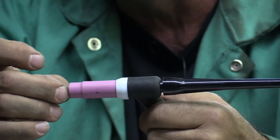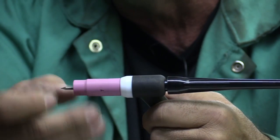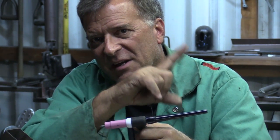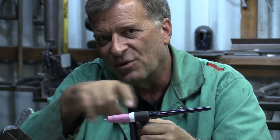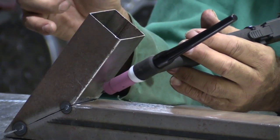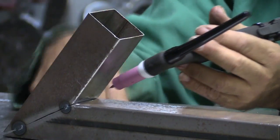One of the things you can do is just go ahead and pull your tungsten out just a little bit farther, and up the flow rate a little bit on your regulator — get a little more gas flow going. So when you get down in there, you're dumping a little more gas because you've got just a little bit farther to go, which can get a little better coverage.